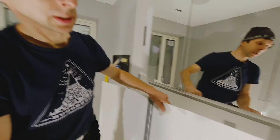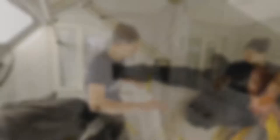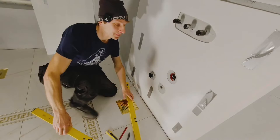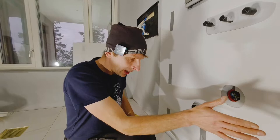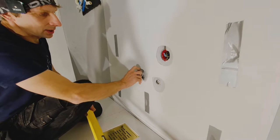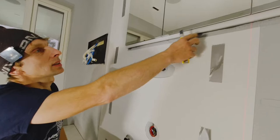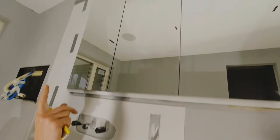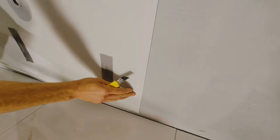Once we have finished, this masking tape will be used to put this piece of stencil on the tile, not to shift it a single millimeter. This stencil has been put on the wall. Where there are openings for holes, let's cut out freely — you don't have to do it up to a single millimeter, just leave some space around. The same is true for the floor and ceiling. We put the stencil, put a laser marker on the edge of the tile — it's going to be right in the middle of the cabinet — and then we start marking.